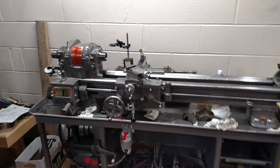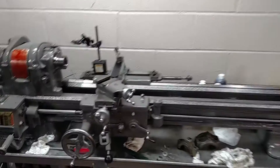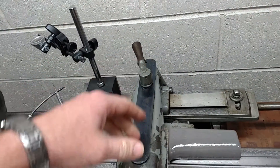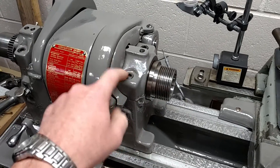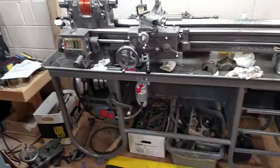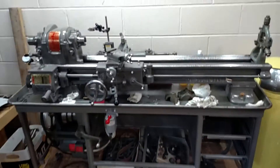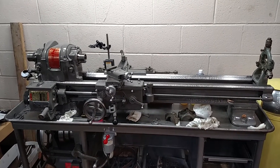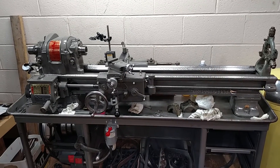Kind of an update on the old South Bend. Hopefully a few more things I've got left to do. I'm going to paint that tailstock, get that guy on there. The more I look at this thing — I might take the taper attachment off, paint it, or leave it until I actually get it scraped in. I'm running out of time here with school. I've got to set my shims on my bearing — I think I've got to take maybe a shim off one side and a couple shims off the back because I've got a little play in there. She's damn near ready to go. I've got my cabinet door and drawers to paint too. It's starting to get chilly out so I've got to get to it. Another update on the old South Bend lathe. Until next time — stay safe on your machines. Be sure to like, comment, share, and subscribe. See you guys later.